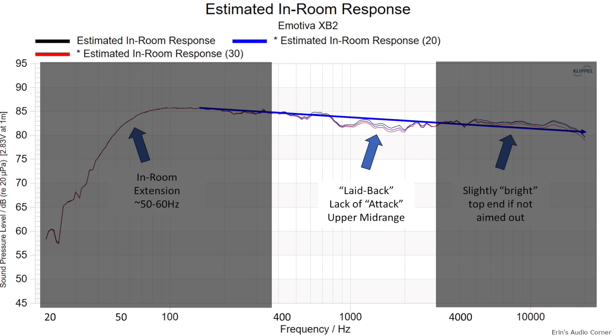This is typical with most standard two-way speakers, especially if the tweeter is separated from the midwoofer. In this case it's an AMT tweeter, separated but not super far. The further the tweeter is from the midwoofer, the lower the crossover point needs to be — but most budget speakers can't implement a low crossover frequency because it costs extra money. That scoop in the upper mid-range is due to a non-ideal handoff between the tweeter and the mid, compared to speakers with a waveguide or a three-way design.